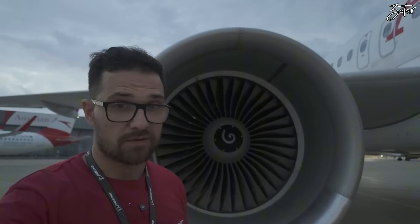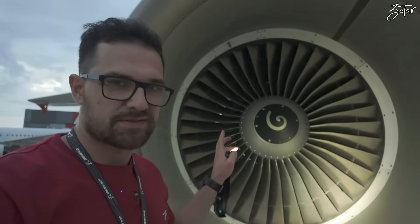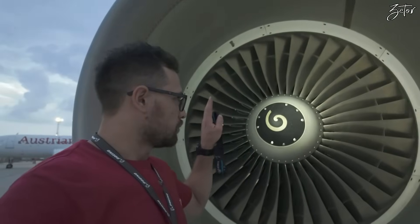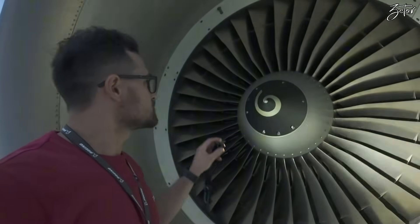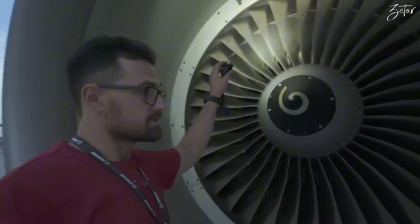But we're going to use the CFM-56 adapter today. Why do we actually need to perform engine wash when airplanes fly through rain quite often? Well, that's not really sufficient. Those huge fans are basically centrifuges — water is heavier than air, which means that whenever water hits the fan it is pushed out to the cold stream. That means almost no water will get to the hot section in that inner smaller circle.